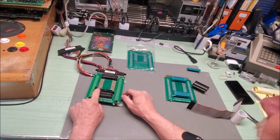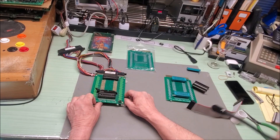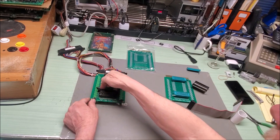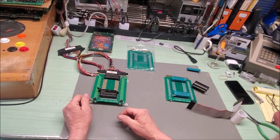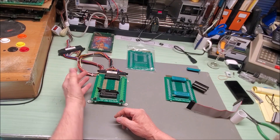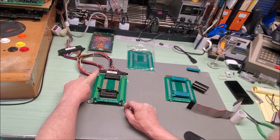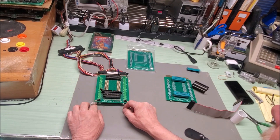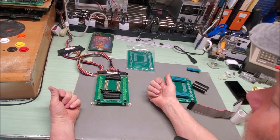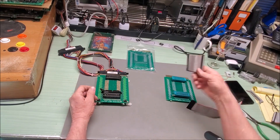The other thing I found is you could use like Dupont or Arduino headers and stick them on the first five or six. If you're testing the cable, put them there — put them on the bottom after you've crimped them all — and then turn it on and it'll show lights on that side that you've done. Half over here, half over here — actually just half here. It'll show them all on whichever side you put them on. So these pins can do more than just ribbon cables or IDC connectors.